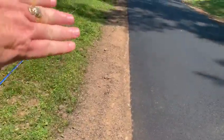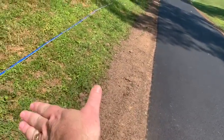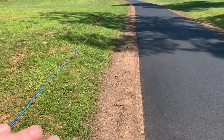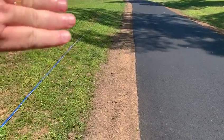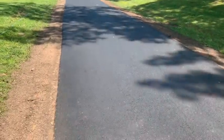Two, it helps with water drainage. The water is now banked away from the surface. Instead of water coming down this hill and cutting under this driveway, it's banked away — it's going to roll this way. Or if it's a situation where it can't be banked away, when the water hits it, it will sheet flow over the surface of the pavement, which also won't hurt anything.